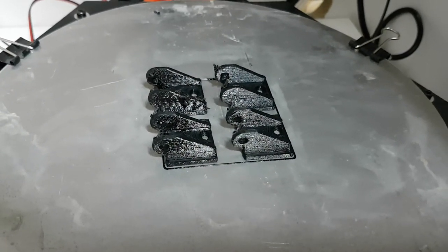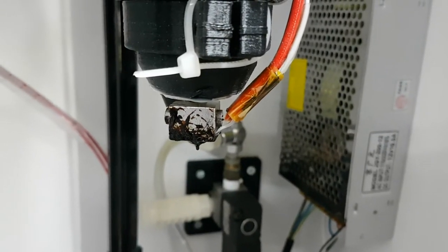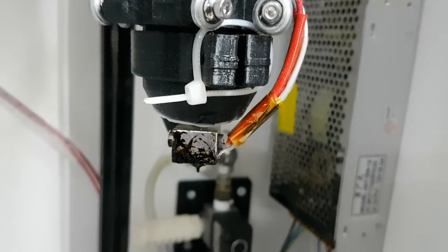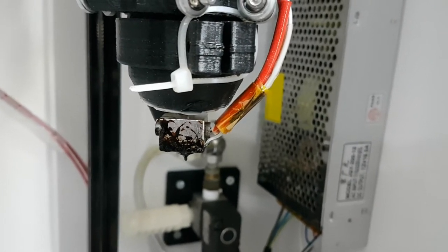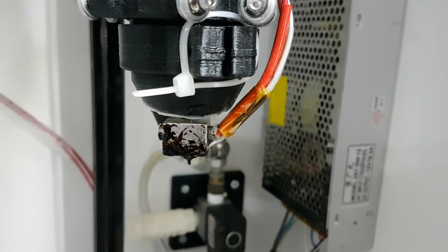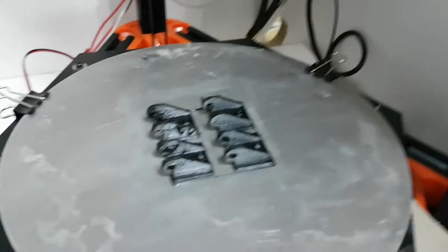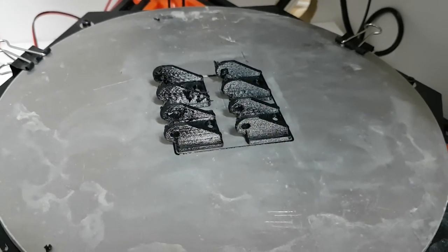This is printed with a 0.6mm tip, but the hotend is one of the shorter blocks — it's not as deep as the Volcano — so the speed limit on this machine is actually the hotend. When this thing actually plays up, I'll switch it out for a Volcano with a 40-watt element. But while it's working I'm going to leave it in peace. I reckon this thing's gone through about 10 or 12 kilos since I've had any trouble with it. It's been a great reliable machine — I'm very satisfied with this printer.